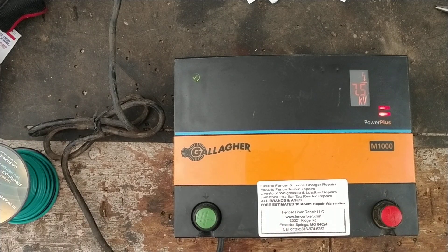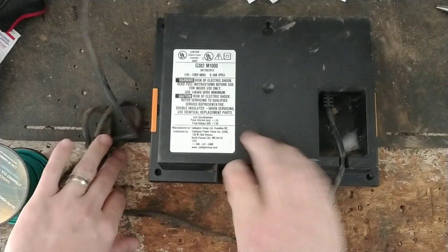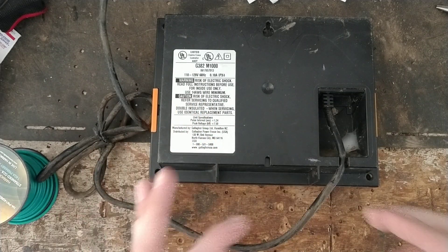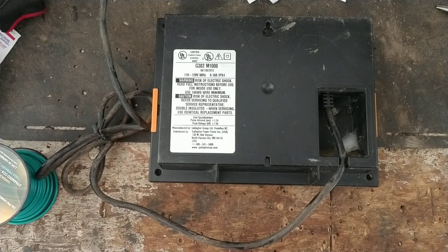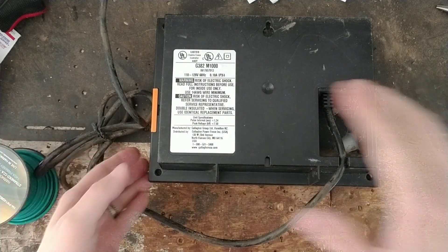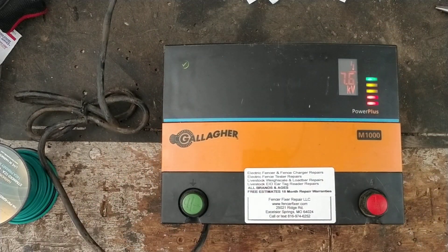The issues with the second version board involved a bunch of surface mount components — a lot of digital electronics — and a big cluster of parts on the back side of the board, maybe around 20 of them. They'll get hot and burn out, sometimes from lightning or stress, sometimes just from age. Most times they don't go bad very often unless the unit is older, has been hit by lightning, or has a bad short on the fence causing them to work hard.